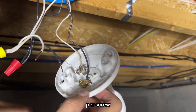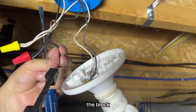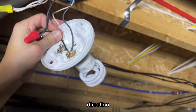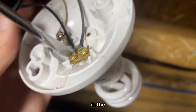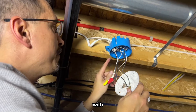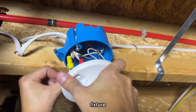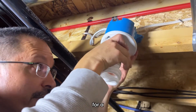You don't want two or more wires per screw. Give just a tiny little bend to the wire to go under that screw. The direction coming into any screw, you do want it clockwise. When you tighten that down, it will pull the wiring in even tighter. Don't go counterclockwise — you'll pull the wire out as you tighten the screw. With the grounds all connected from the existing wiring to the new, and the hot and neutrals all connected, we are ready to fold in our piggy tails and our light fixture into the workbox. Your electrical workbox will be rated for a maximum number of wires.